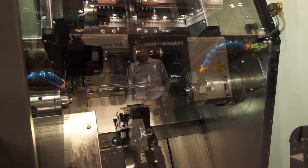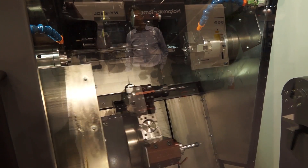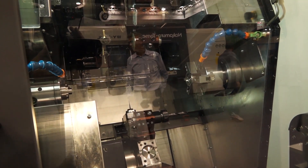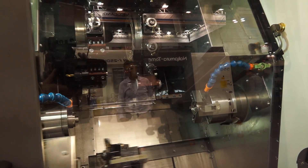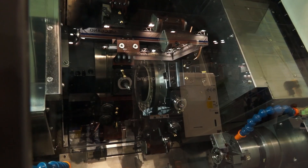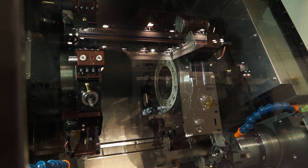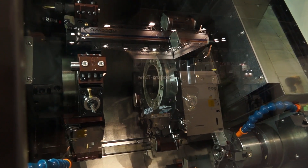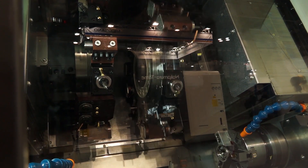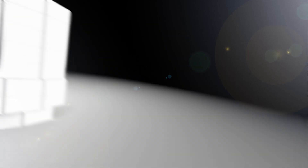The chuck size on this machine is actually a six inch chuck. When I look at the axes, we're talking about two spindles. We've got three Y-axes, two C-axes and we've also got B-axis. So you've got complete capability from turning, milling — all of those characteristics when it comes to multi-axis machining can be achieved on the NTY3.